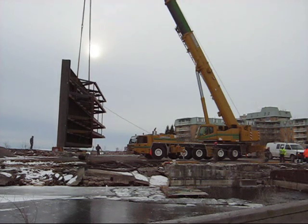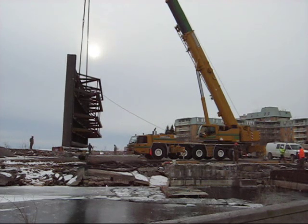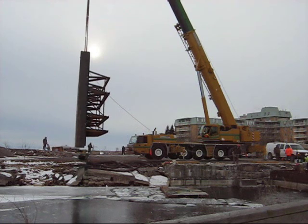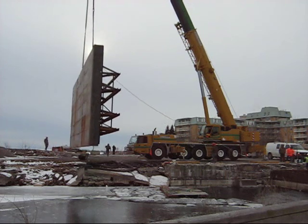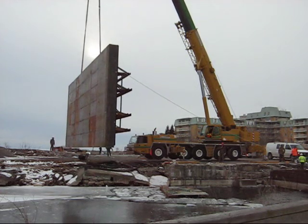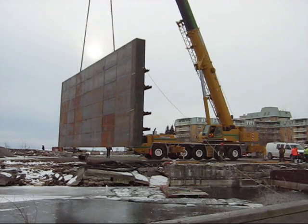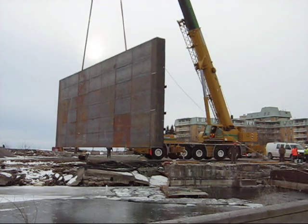Okay, I'm with Michael Dent. I'm a structural engineer working for Dornekamp on this Drydock project in Kingston. And the Cofferdam is about 60 feet long and 24 feet high. That's a 24 feet possible depth of water. It has a variable thickness faceplate in 8 foot wide panels and four big trusses running horizontally. Three trusses are identical and the top truss is a little bit lighter in fabrication.